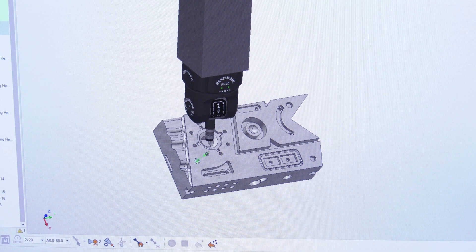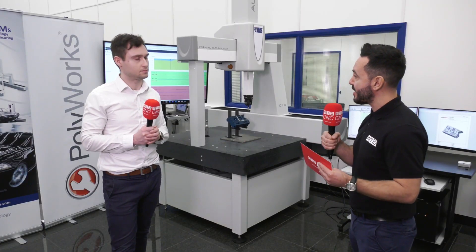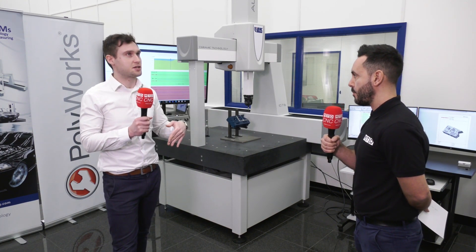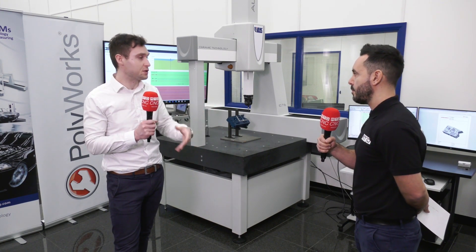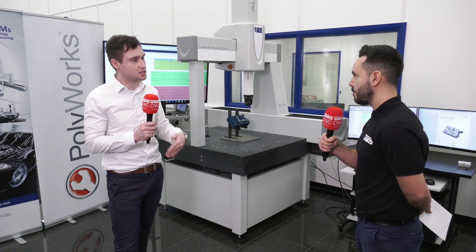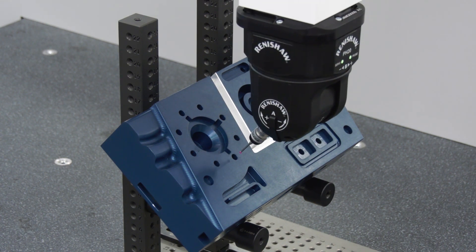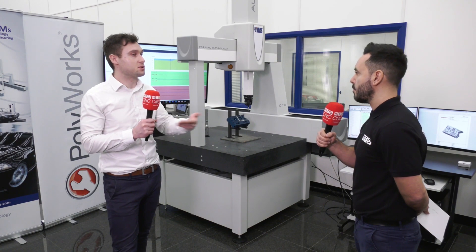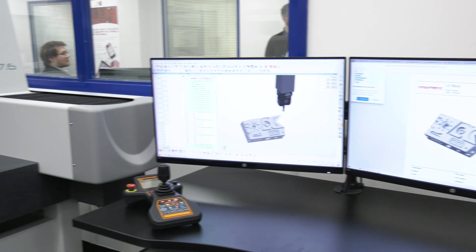If I was an end user that just had an LK CMM and I was just tactile probing but I wanted to upgrade to scanning because I thought it might save me time — how would you sell that to me? Well, first of all, we start at the start — you don't have to buy the level of software you're not going to use. If you just have a manual probing system, you buy the manual probing version of Polyworks. If you then in a few years want to move up to CNC, you upgrade your level of software. You can choose scanning, CNC probing, or both. There's no difference in the upgrade cost — you always just pay the upgrade fee. It's very much like Lego blocks — you're just building one on top of the other to suit your needs.